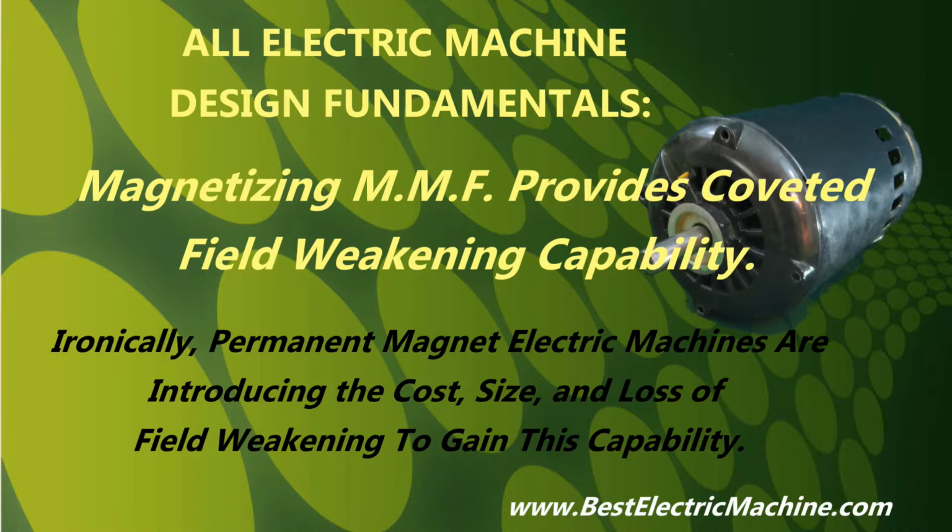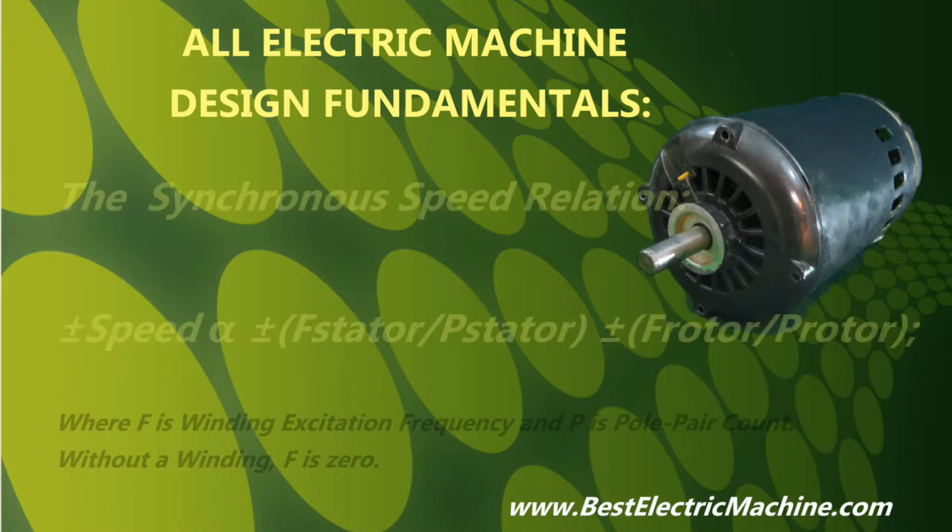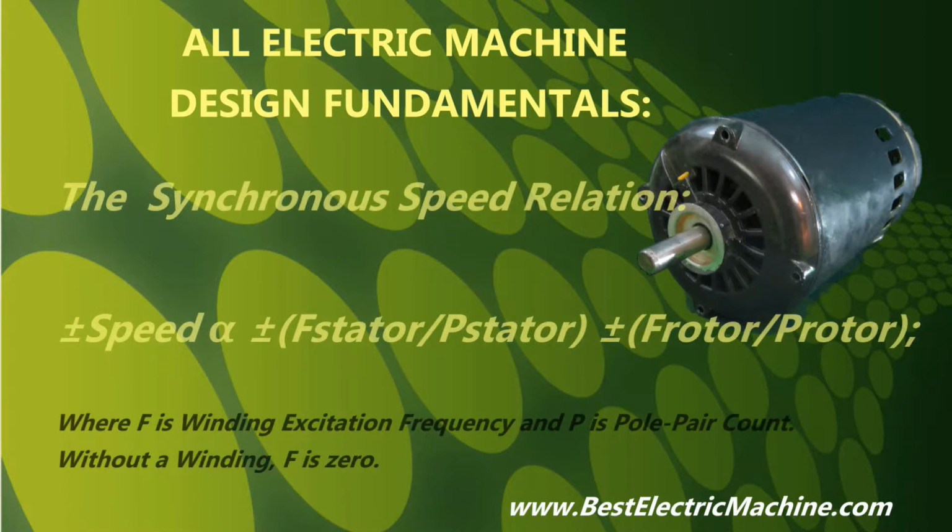The electrical excitation frequency versus speed of any electric machine must be in accordance with the so-called synchronous speed relation for useful torque production, which states: rotor speed and direction is directly proportional to the sum of the product of the stator multiphase winding excitation frequency and the inverse of the stator winding pole pair count, and the product of the rotor multiphase winding excitation frequency and the inverse of the rotor winding pole pair count, where speed and excitation frequency can be bipolar, i.e., positive or negative, and the excitation frequency would be zero for a rotor or stator without a multiphase winding set.